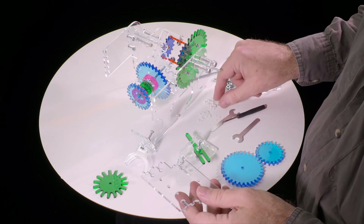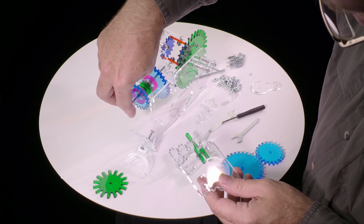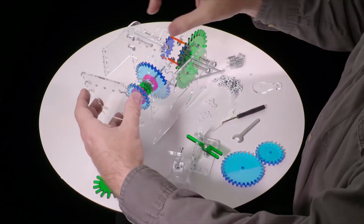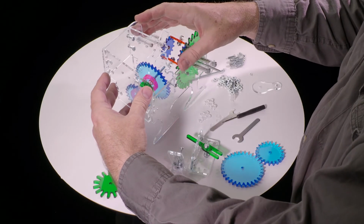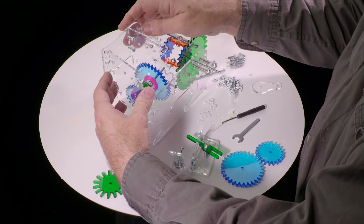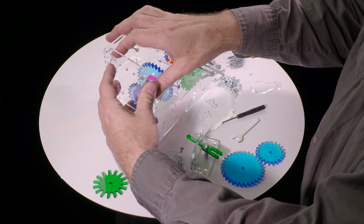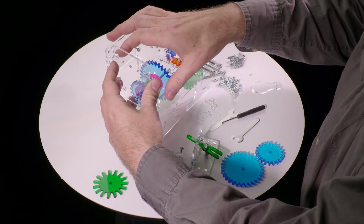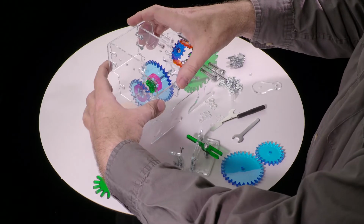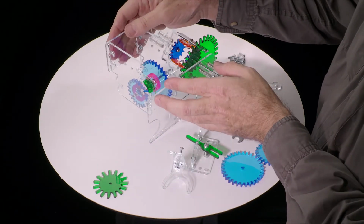So next we take another of the 5mm washers, stick that on the end of that shaft, and then this is why we left these screws loose. So put the drive shaft through the output shaft, and then we sort of spread these two out just enough to let that fit in, and those tabs engage. And if these were tight, then you'd have to bend that too much and they might crack.